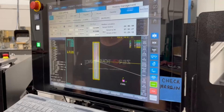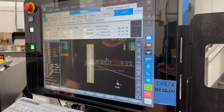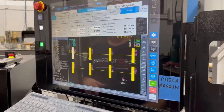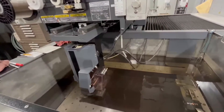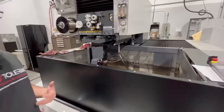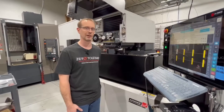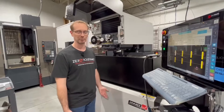It's going to cost more in wire and electricity, but we're not paying someone to stand here and wait. When we come in the morning, we'll have eight pockets completely done, all within tenths of each other, and then the inserts can be fit in process. This machine will run all night long. Some places don't trust running their machines at night, but with Industry 4.0 monitoring I can look on my phone and see if the machine stops — sometimes I have to come in and turn it back on because the wire broke — but that's keeping the work moving even though it's a slower operation.